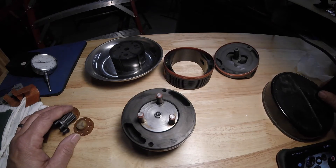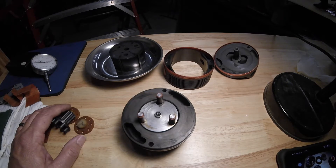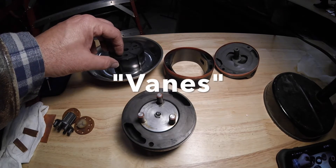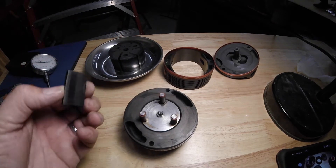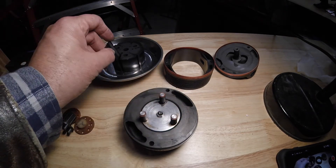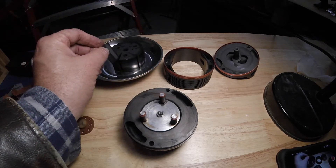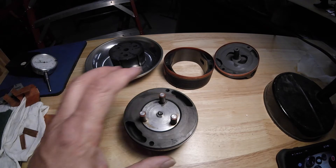So I went and asked my mechanic if they had any vacuum pumps, and he said go pick one out of the pile — because these things fail fairly regularly. The thing that startled me was how thick these wafers are. I don't want to break it before the cutaway. So basically, this is graphite wafers. What it does is it works the same way that an air motor would work, except it works in reverse — this is the driven part.